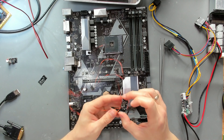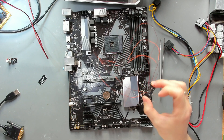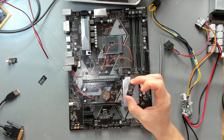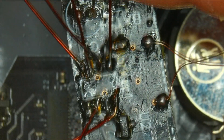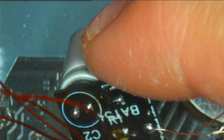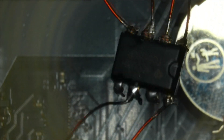After that failure I switched to version two. Going under the microscope, you can see this looks like a spider — the through-hole 555 timer soldered with lots of enameled wire to the board, the resistor in between, the diode, and the capacitor on the other side of the board, with output wires running to the spider-like 555 timer. Interestingly, this circuit actually works — it was my proof of concept that my PCB design was correct.